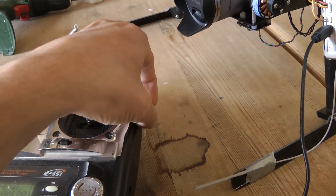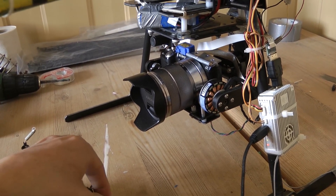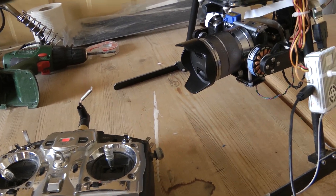The gimbal doesn't seem to move, so I might need to calibrate the radio. When I connected the Wukong M to the computer in the system software, I saw a CFG error. I tried to press calibrate but nothing happened — the graphs wouldn't move when I moved the sticks, so there was no response. I then had to re-upgrade the firmware on the ground unit and the air unit. Then I calibrated in the DJI Lightbridge software, and then I was able to calibrate in the Wukong M, and now everything works.